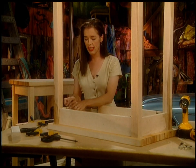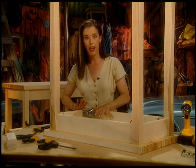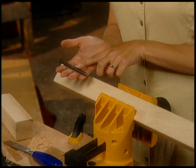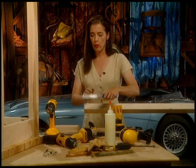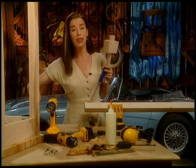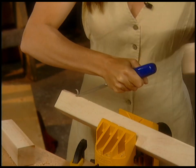Now the magic of hardware - see how pretty this is? Four screws go in the bracket, and then this big hanger bolt goes into the leg and tightens with a wing nut. That is so solid. I'm going to make a flat spot so I can screw the hanger bolt into place. It's threaded for wood on one end, and has a machine thread on the other end for the wing nut. You have to chisel with the bevel down, otherwise you'll chop off the whole end of the board by going too deep. Use the biggest hammer you can find, and wear your safety glasses. Take progressive cuts until you have a flat spot you can drill into easily.